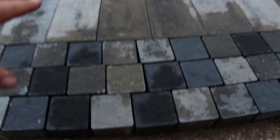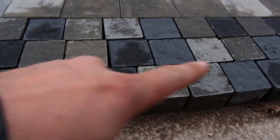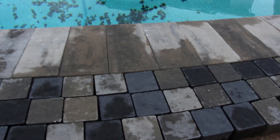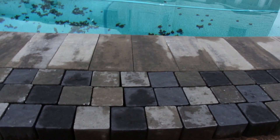The banding essentially helps us with laying and cutting. When we lay our slabs up to these, we can remove the banding, lay the slabs right up to the coping, place the banding on top, draw a line, and cut — or we can lay right on top of them, draw our line, and cut in place. The reason this banding helps is it gives us a little more room, so if a slab would otherwise be hanging well over the coping piece, we avoid that tricky situation with a curved pool.